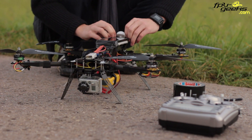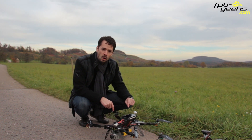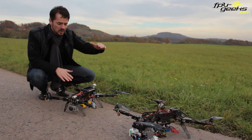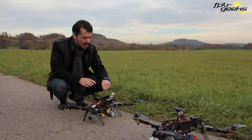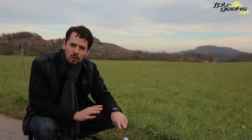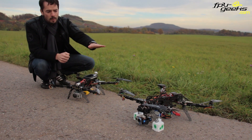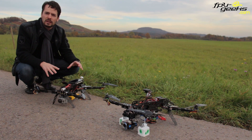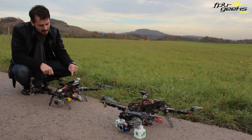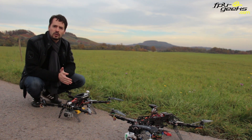Before we start, we have to arm both copters. Then we set follow me mode on the cell phone so the following copter goes into hover. Then start the follow mode on the smartphone. I also have a Pebble watch and I can control the modes from it too, but we'll try that later. The first step is to hover the copter which is supposed to follow, while the other one is manually controlled from the regular transmitter. Then bring it to hover, set follow, and fly around the meadows over Maltbron.